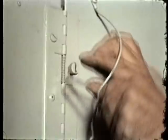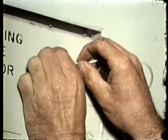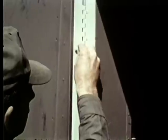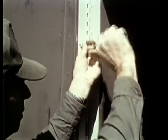The interior of the expandable shelter has removable panels which are interchangeable with the door panels. Use screw fasteners to secure the door. Remember to connect the bonding wires. Attach the mounting screws to secure the door hinge. The expandable shelter is now set up and ready for use.